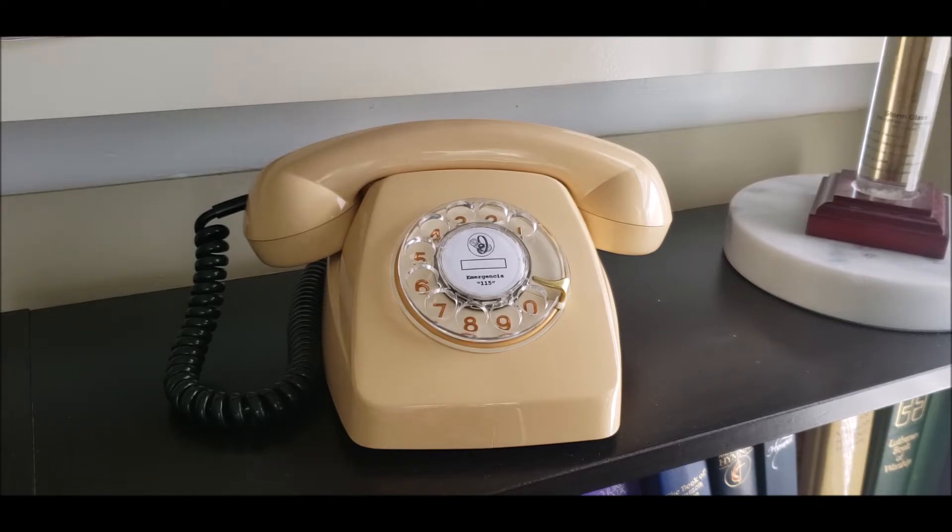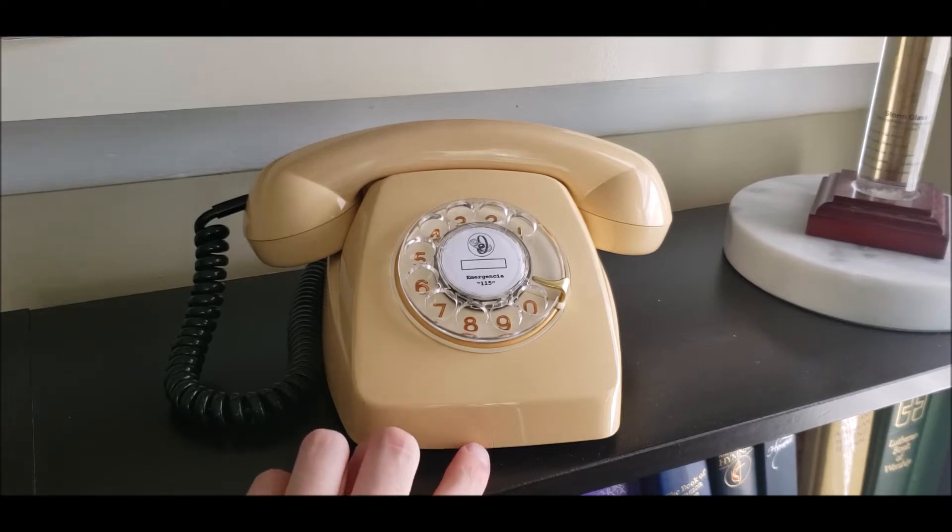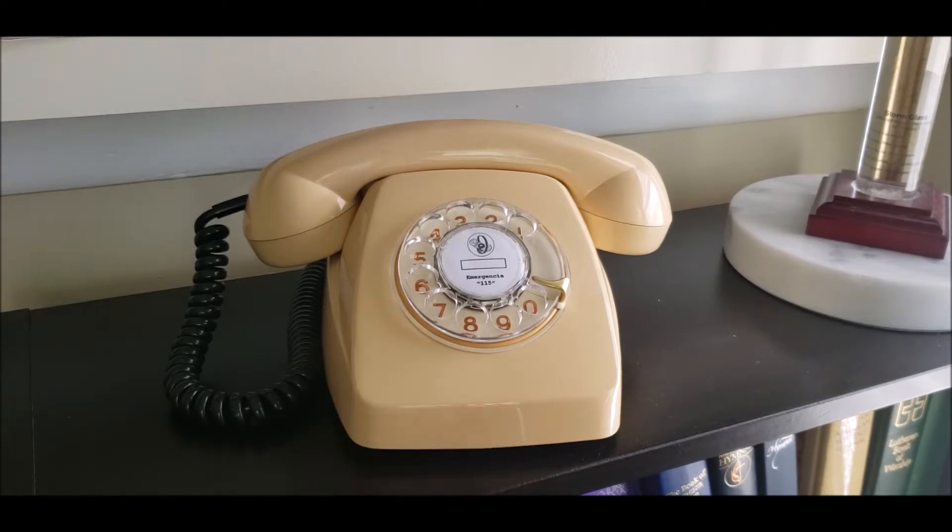This restoration was basically a success. All I had to do was put the plastics in warm dish water with some soap, let those soak for a while, used a sponge, and cleaned those all off. Then I used Novus No. 2 to polish all the plastics to bring them to a nice shine. The phone is in good shape with the exception of the crack in the center here.